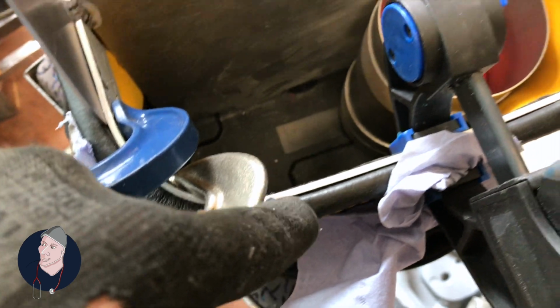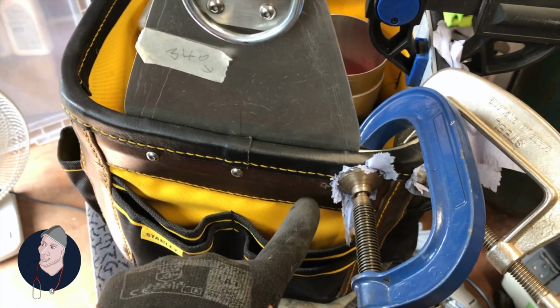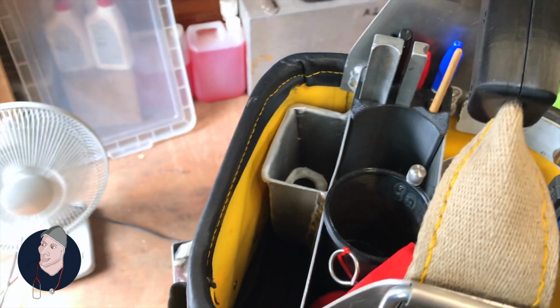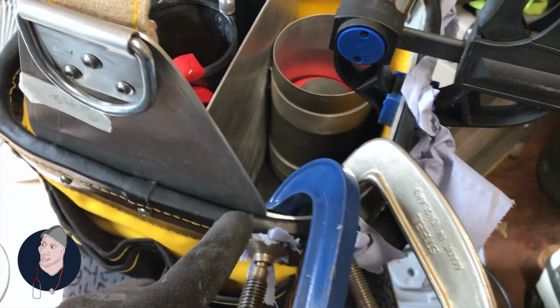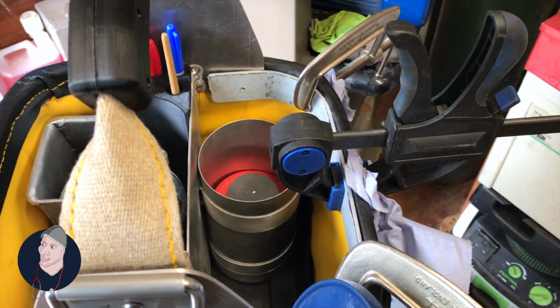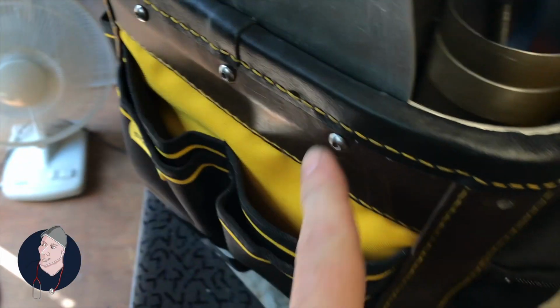But in order to do it, I've had to measure correctly, clamp it, drill through here for M5, and then we'll thread it on the inside, and that'll bolt together, and hopefully that'll be a finishing piece on the inside. Got to do the other side yet. I may weld it, it depends how easy it is to get in and out, but some seriously sort of clamping and measuring and making sure it fits and bending it round this nice curve here. So that's it with one hole tapped through.